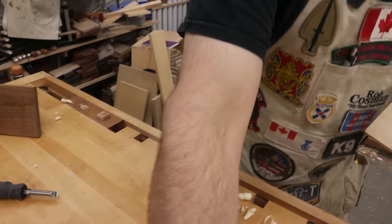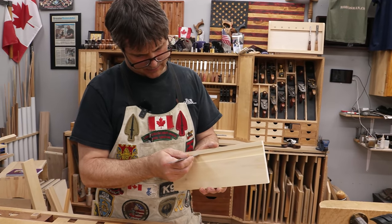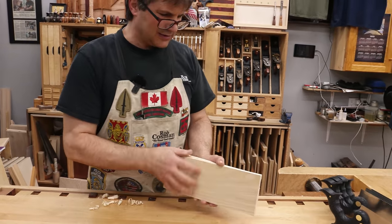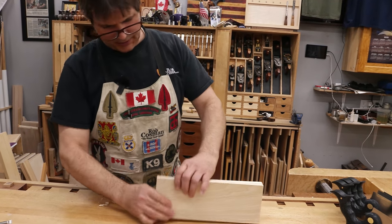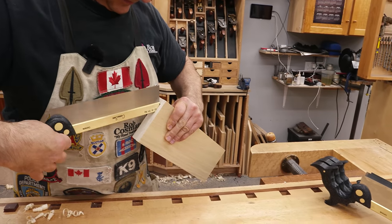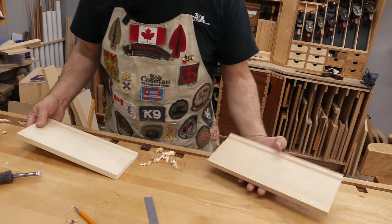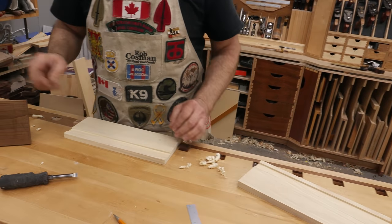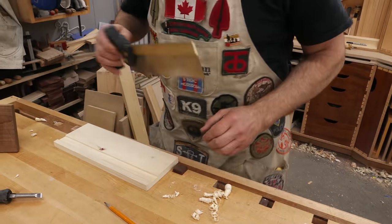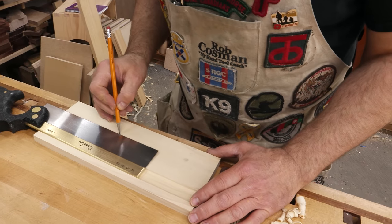Okay, check the depth — it's just a little more than an eighth. I'm going to see if I can stick the end of the saw in there to check the fit. Yeah, there's lots of room. Now the rest of it — the part for the blade — we can actually do that with the router plane because it's not very deep at all. Since I'm going to make this one specifically for the dovetail saw, I don't need to make it as deep, so we'll go down to about here.